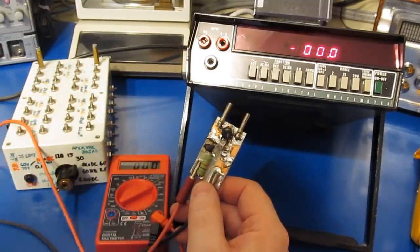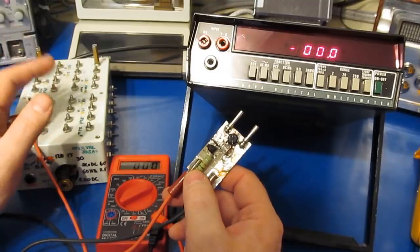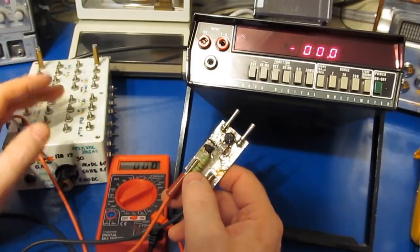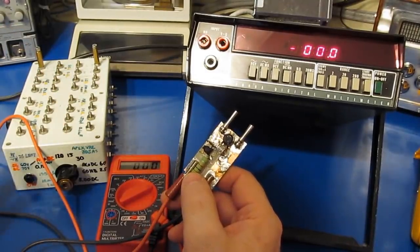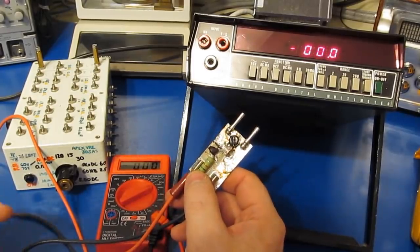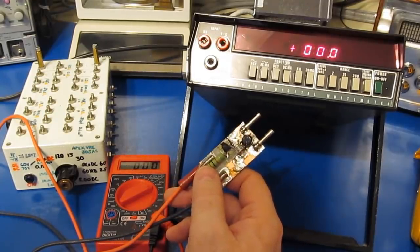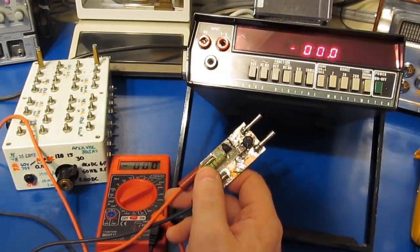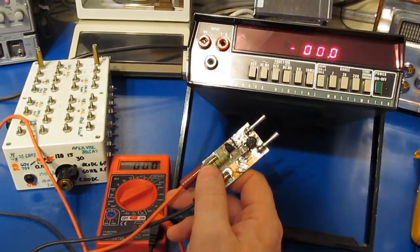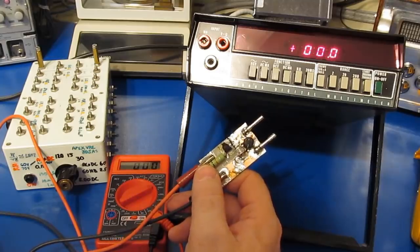Again, to be clear, I don't do any kind of work here on my bench with any sort of high energy circuits. The high voltage isn't really an issue for most of what I do here because there is such a low energy involved. So from a hazardous standpoint, I'm not usually too concerned about it. If I play with currents that could be lethal, I typically take precautions. Even when I'm transient testing the meters, you can see that I'm usually not touching things, especially if I use that half cycle line simulator. I'm quite a ways away from the meter when I actually set that thing off.